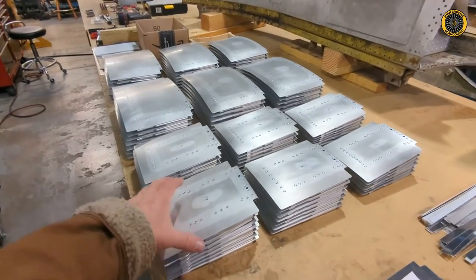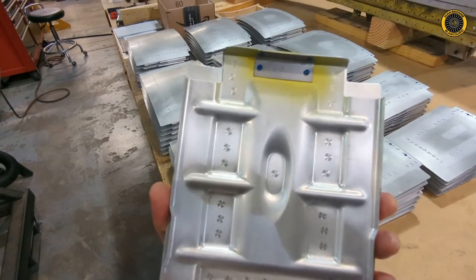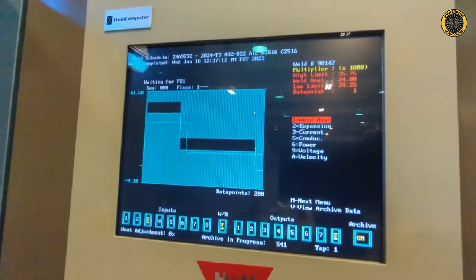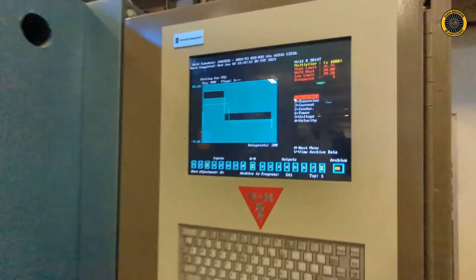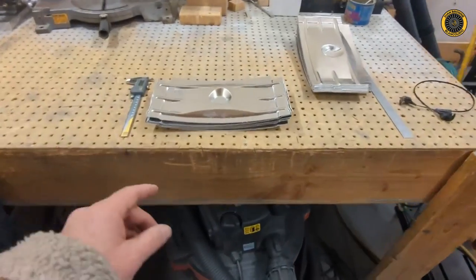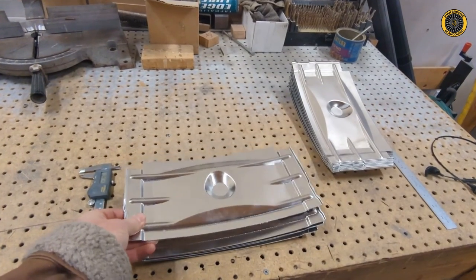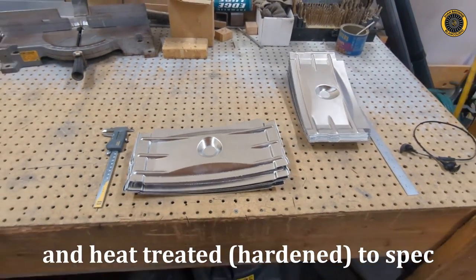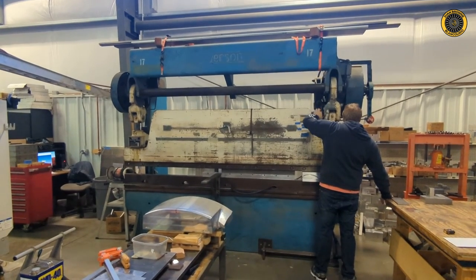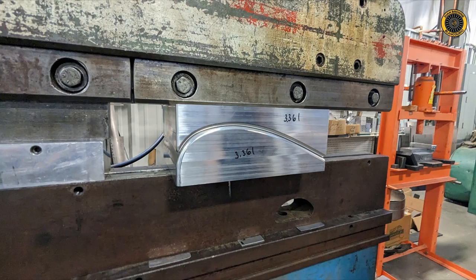Here's a bunch of the brand new cowl flaps being made — spot welded, created from scratch, from original plans. 90,000 spot welds so far on this spot welding machine in this shop. Here are the pans for the cowl flaps. Like a lot of this manufacturing, it starts out as dead soft aluminum, gets stamped out, and then worked from there. All these things run through this 60-ton press — Big Blue — which hydraulically smashes them in the dies.